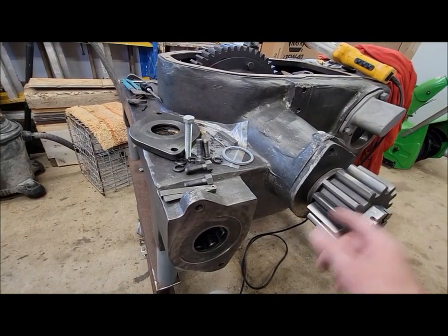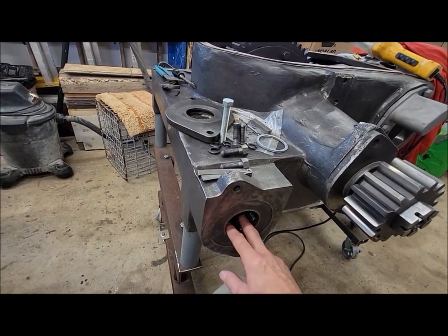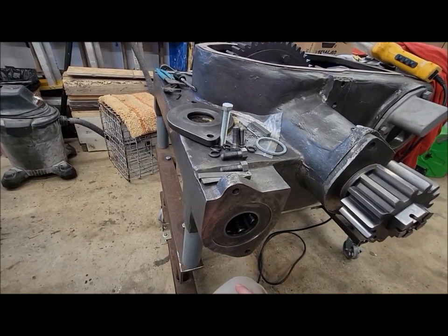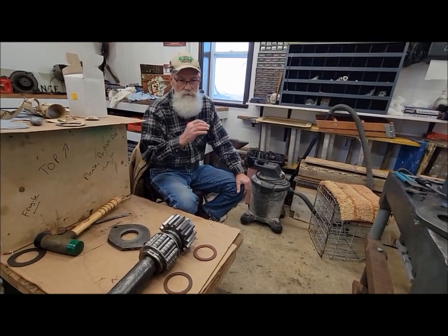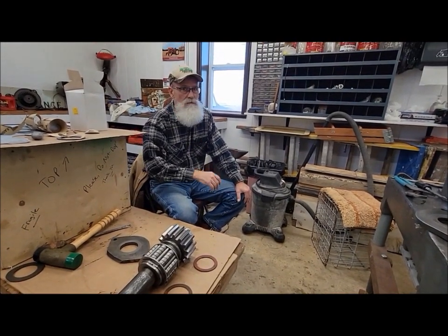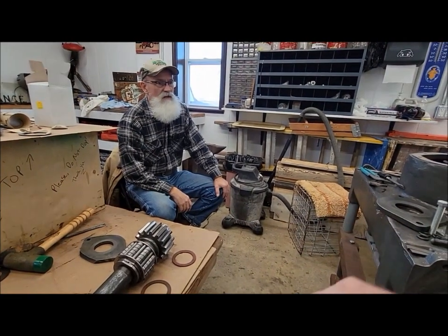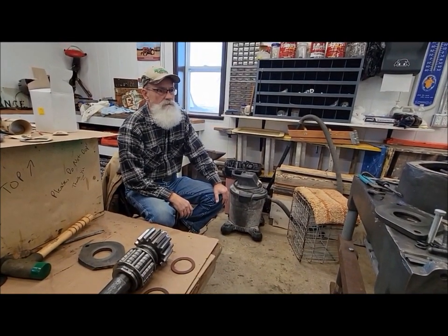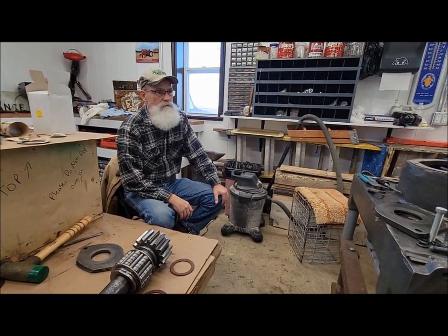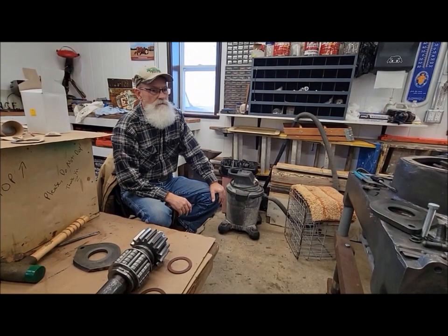So probably because they were actually turning all the time, where these were just kind of sitting there working on the axle. Like you've said, that's the worst thing for bearings, is not actually spinning. A little bit of moving or rocking back and forth is really hard on bearings, where constant turning is actually better for them.